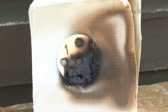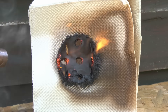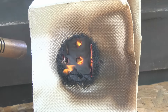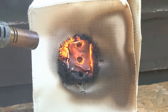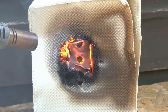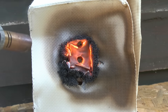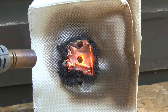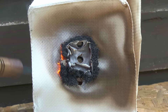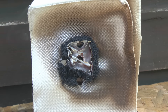Now let's go back to the fire hood. You can see the part on the side — that's the material designed to expand. Heating it directly with the flame, you see the stuff bolts up and there are individual fibres designed to seal those ventilation holes. They are doing this to a certain extent, though the one in the middle isn't sealing over very well. The outer ones certainly are. But as the flame is continued, the material tends to turn brittle and fall away, leaving the holes fully exposed.